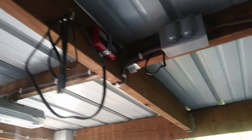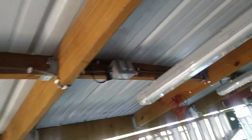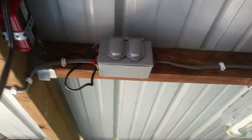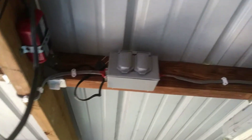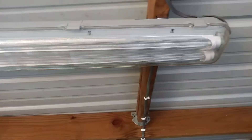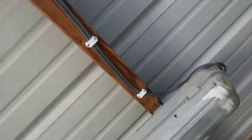He dropped them down and plugged the chargers in over the winter to keep the batteries trickle charged. Joe Smith wired up the outlets in every section — outdoor rated outlets in outdoor rated waterproof housings or boxes. Of course, outdoor IP65 rated light fixtures.